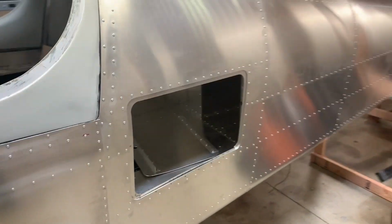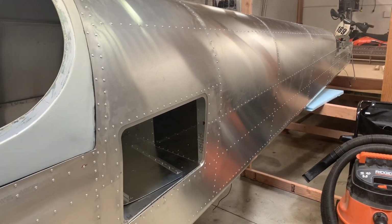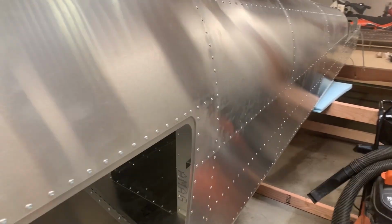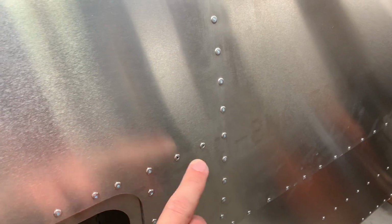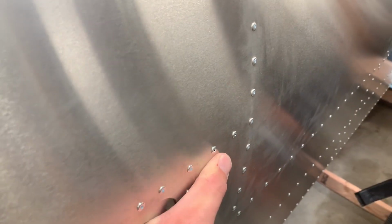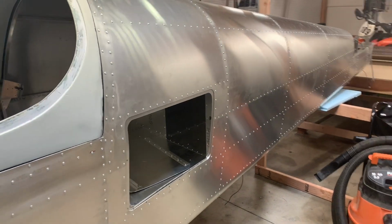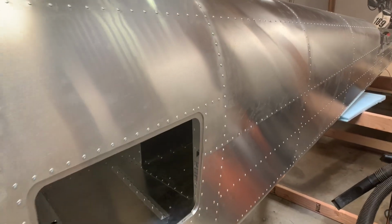And I kind of got desensitized to having extra parts or missing parts along the way, and I didn't even think to fit it with both. So I drilled out just these two rivets. Those are the only rivets that go through those shims. I drilled them out, put them in the second shim, and it solved it. So thank you to the people who pointed that out and convinced me to go back and take a closer look at it. It's much cleaner now.